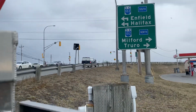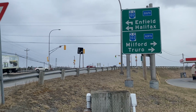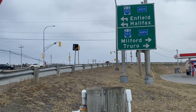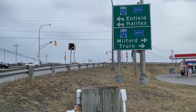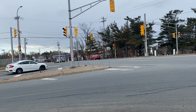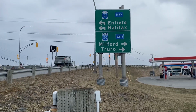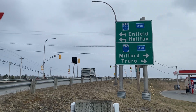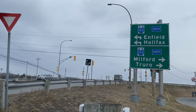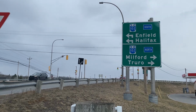over here, so now there's a call on phase 8. So we're almost about to gap out here. So that will serve phase 8, and this will give you your lagging arrow. But that will drop. That's still green. So that gives you green there. And then that will reserve the green. And I have a PED overlap on that signal over there, so that will actually call 2 and 6. So the reason for that is because 6 typically is always on before 2. 2 comes on, it will resurface that ped call.